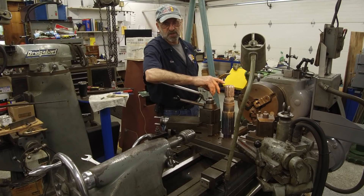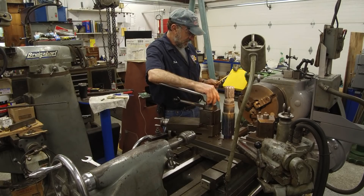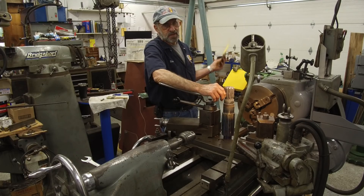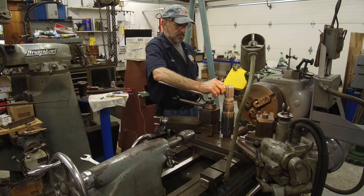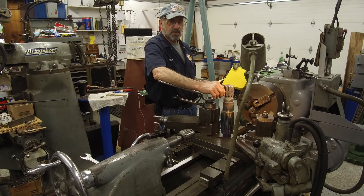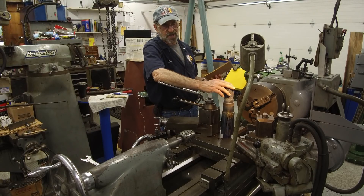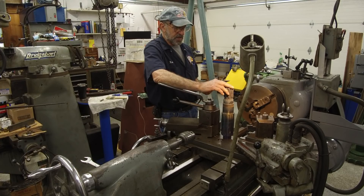There are a lot of things you need to know: the root has 15 thou per side radial clearance, it has 10 teeth, the tooth width is 348 thou. I'm getting about 350 on the females and about 348 on this one, so I wrote 348 to 350 — we'll get it on the fit. The root diameter is 1.900 and we measured it at around 1.930-1.931.